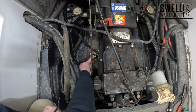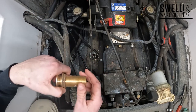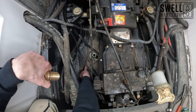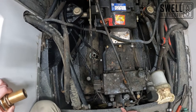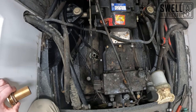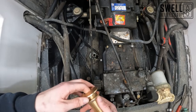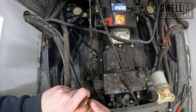We're going to cap the old fitting — it's only half an inch, whereas these new ones are a full inch, so we'll get a lot more flow. We'll cut and mark this hole, move the magnet to the next position for a second hole next to the old fitting, and then go to the other side of the hull for a third. That gives us three through hulls for the three pumps. We use 4200 fast cure with these fittings — it takes about 24 hours to dry.